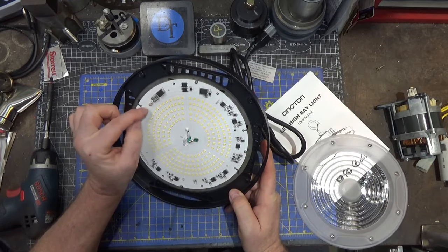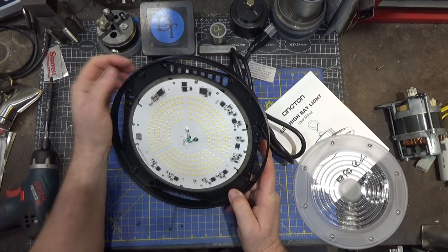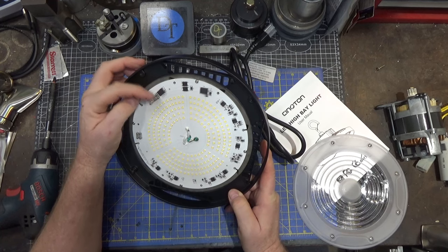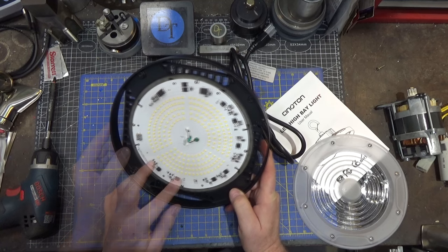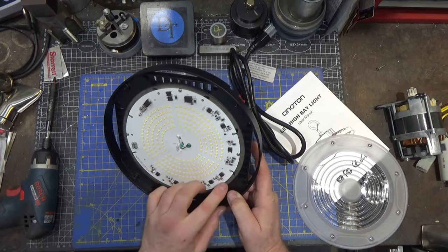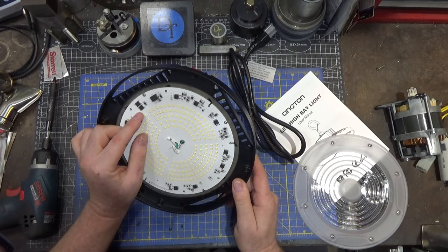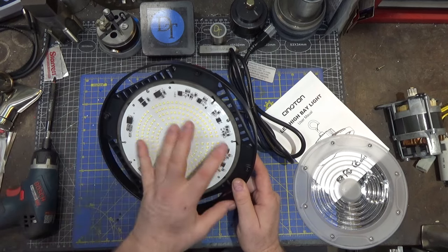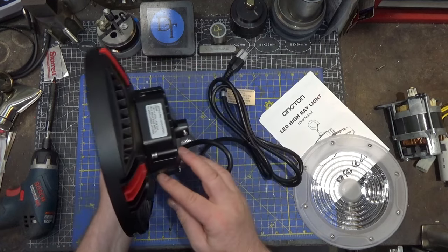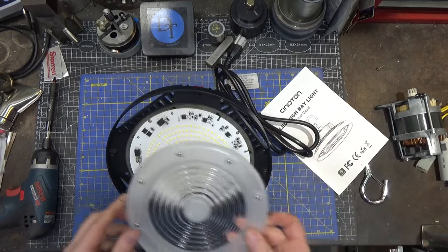Taking a closer look: there's a fuse on the front — Fuse 1 — and then what look like resistors with very small values, around 0.01 ohm, so they're using resistors as fuses — interesting choice. There are MOSFETs and it looks like an IC for each one, so maybe these are separate driver circuits. There's no transformer visible, possibly direct AC conversion from the line. There are two full-wave bridges, so they may be taking AC in and generating DC directly. This PC board may be all there is — the rear section might have nothing.